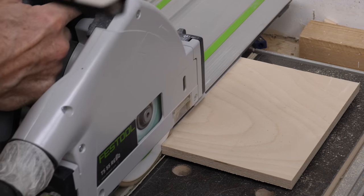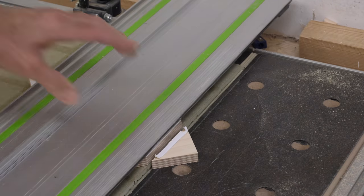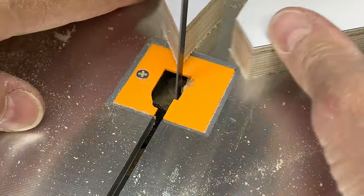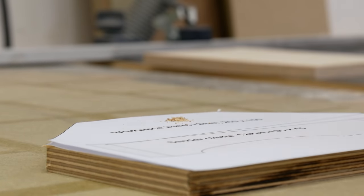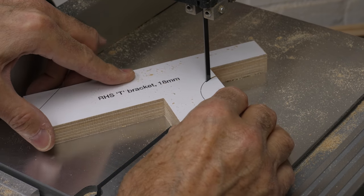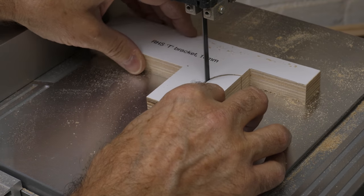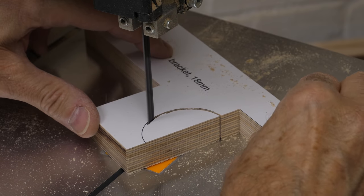The length of the brackets depends on the size of your workpiece base — 200mm for the brackets in my case, and 210 by 150mm for my base. I'm cutting off the corners of the brackets and the base to make it look streamlined and space age — well, something like that anyway. I've also drilled a hole for the workpiece knob at a convenient place. When fitted, the right-hand side T-bracket needs to be long enough to reach the back of the left-hand L-bracket, as this is where I'll position the bar that clamps the sander down. I'm using 12mm plywood for the bar, and the right-hand side of the T needs to be 75mm off the base for a good fit.